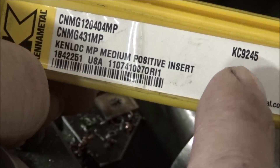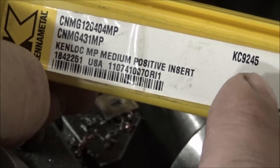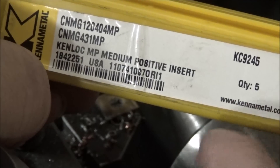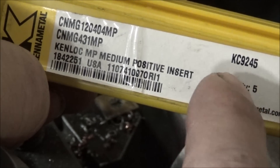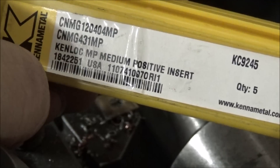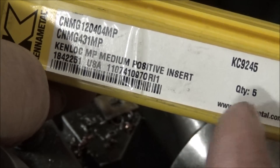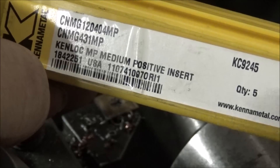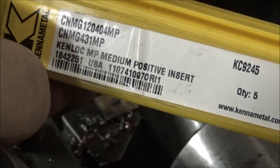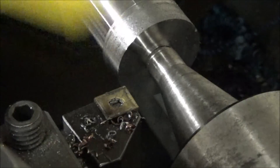Everything is usually repair, so usually working on stuff that's got interrupted cuts and messed up holes and things like that, so the tougher insert is better for what I do most of the time. For this application, a different grade insert would be superior because it would not lose its edge as fast. But I'm still getting pretty good life out of these — I ran 14 tappets on one edge, which was a decent amount of material removal going from an inch and a half down to three quarters pretty much, so more than half of the diameter reduction. Let's show you what the finish looks like on a decent edge.